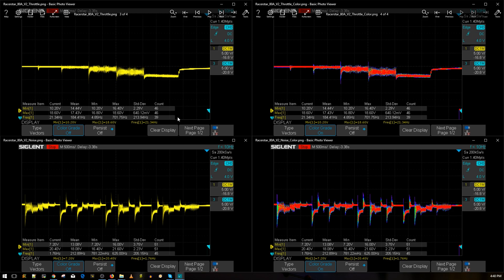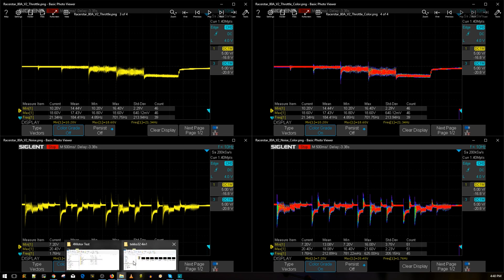Now let's start comparing. The throttle noise looked pretty good — there aren't any voltage spikes, so the on-board filtration is handling itself very well. The heat sink soaked everything right up, which was very nice. On the simulated aggressive flight maneuvers you can see it looks very, very good. It's difficult to understand just by looking at one result, so let's pick up the best ESC and work our way down.